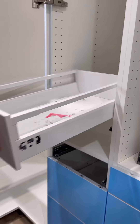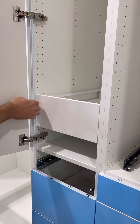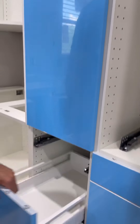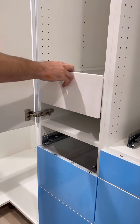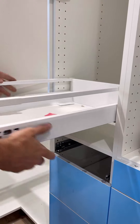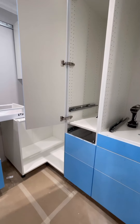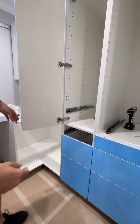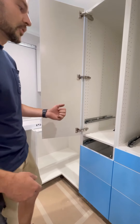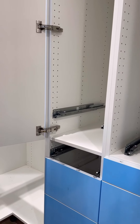So now you can put your track on and put your interior drawer in — that's going to allow it to clear that drawer. That's the difference between an exterior drawer and an interior drawer and how you put the track on. Also, with the interior drawer, you have to have the 153 hinges in order for the drawer to clear the door to open. That's how you do your tracks and your drawers. Thanks for watching.